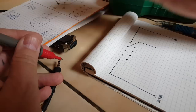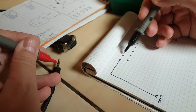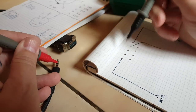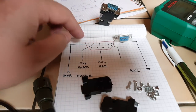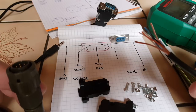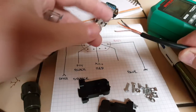Alright, enough rambling — let's just build a cable because I have to get outside and make some contacts. So here I'm trying to find the PTT contact, and I'm going to touch every pin... there it is, second one, right here. I want to make sure it's not connected to anything else on the connector. So this is a little bit of a mess, but here I have the connector for the interface, and I've identified where it connects to the military cable. I've identified the colors here already, but of course nothing to say that yours is going to be the same, so you'd have to make sure. Now all I have to do is solder this on the DB9 connector.